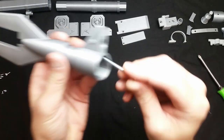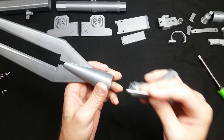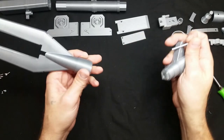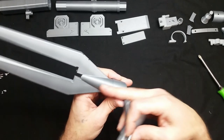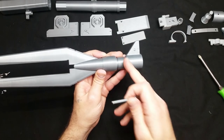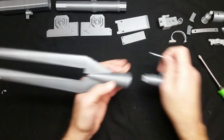I put a screw to go on the back end here. It's not necessary, but I did it for strength, because whenever you make a hole in a hole, of course, it's printing more walls in there, and then you've got this screw in here that threads halfway into here. So where this was a very thin design, this is no longer a thin design. This is rock solid from here to here.